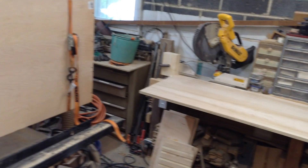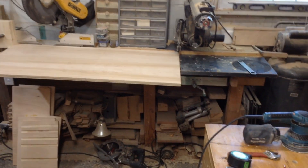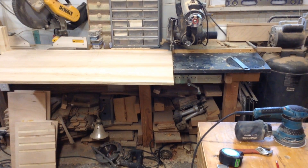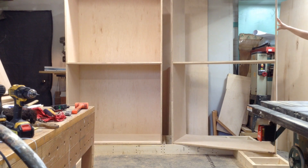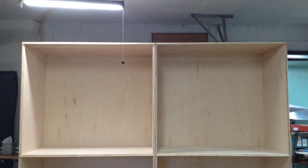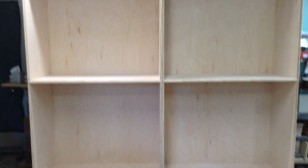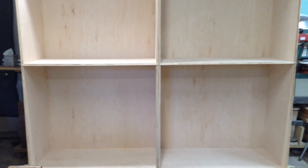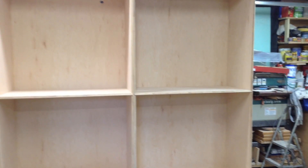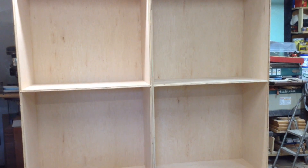I could make the backer in pieces, or I could shrink this cabinet by 15/16 of an inch and put a full 48-inch wide piece of backer on the larger cabinets — that's what I decided to do. With everything still clamped in place, I lowered the fence on the table saw, cut all my shelves down by 15/16, and put it back together. This shows how much sturdier it is with the backer in place — these big cabinets without the back sides are like parallelograms. With no glue or anything in it, you can see my two edges meet perfectly, so I know everything is square. These two large back cabinets are going to get glued up in the space.